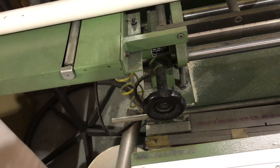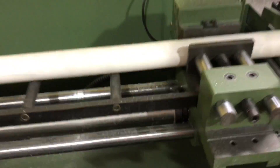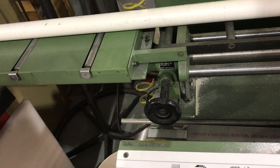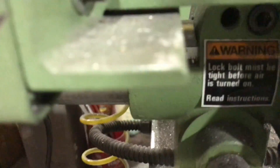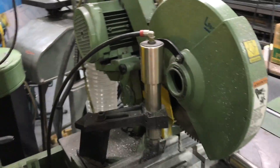So you program the number of strokes. For example, this machine has a maximum stroke of 45 inches, so if I needed something much longer than that I could take several strokes. I could take nine strokes before I cut, but in this case all I'm doing is one stroke per cut. So move it over two and three quarters of an inch and then you have to add the kerf for your blade.